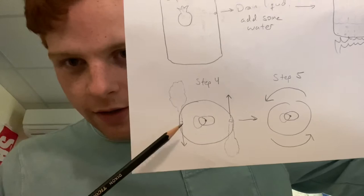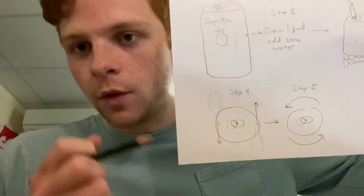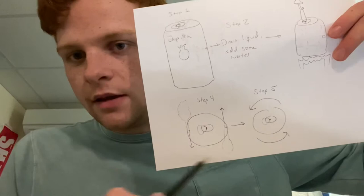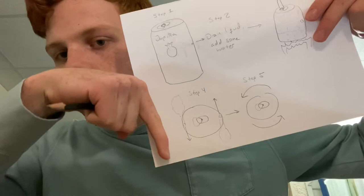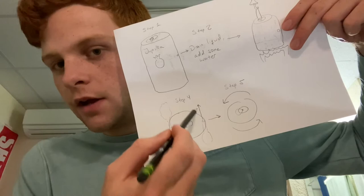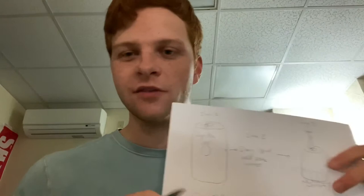The next step was to observe the steam coming out. As I mentioned, there were puffs coming out, but after we put it on the camping stove and there was enough heat rapidly being applied, the puffs were constant and it was enough to rotate the can — that was step five. Because these holes are in opposite directions, this is a coupled moment. As the steam pushes out one way, the can moves counterclockwise, and the opposite side has the same effect, so it gets a nice steady rotation. Once it's rotating, it'll just keep going.